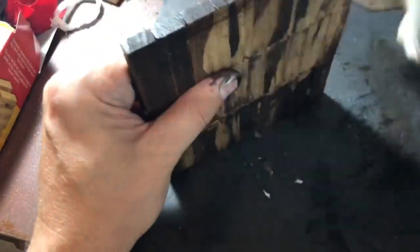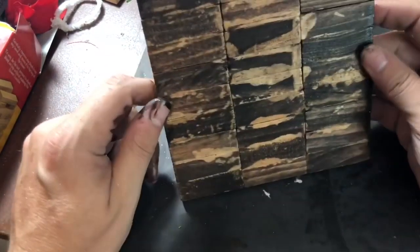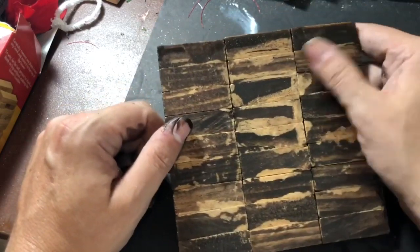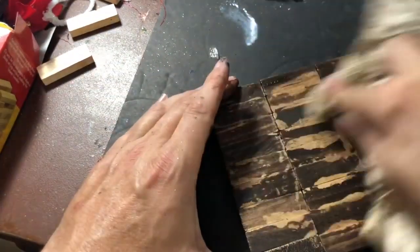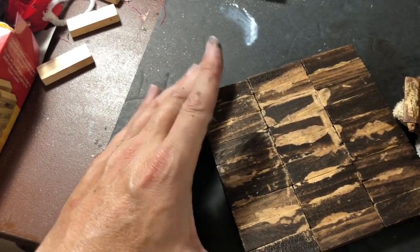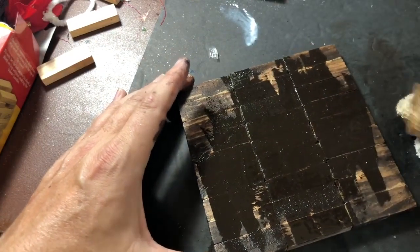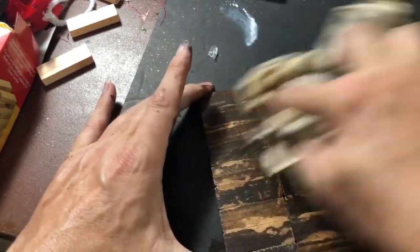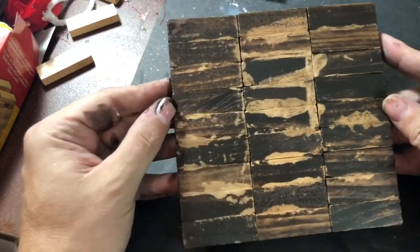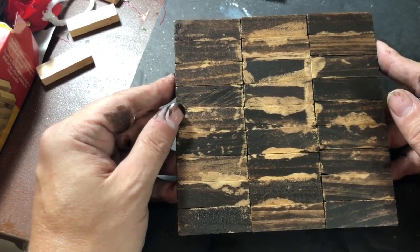I go ahead and complete it on either side of the plaque itself. This is going to make this look like a really finished piece of wood. Where you have some lighter areas, if you want them to be a little bit darker, you can easily go in and just add more stain — it literally is that easy. I'm going to wipe this off a little bit more and then add a little bit more stain directly in those areas where I want to see some dark pigmentation. Leave it there for just a few seconds, then begin wiping it off, and you can see how it has already started to darken it up. Eventually you'll get this to the color that you want. I love this — it looks like burnt wood, like a piece of charred wood that is aged.